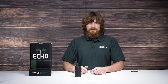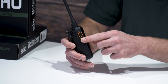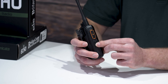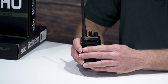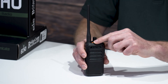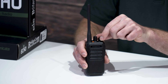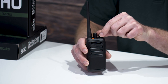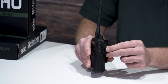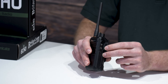Now let's look at the features of this radio. Starting on the left, you'll find the PTT button that's outlined in orange. You'll find the PF1 key, which can be configured to either be scanning or a monitor button. On the top of the radio, you'll find a fixed antenna, an orange button that turns the alarm on, the middle knob which controls the channel, and the rightmost knob that controls the volume and powers the radio on. On the right hand side of the radio, you'll find a flap that you open up, and that's where the speaker mic and the programming cable go. The speaker mics for the Anytone radios are also compatible with this radio as well.